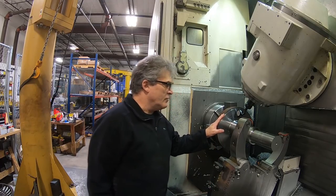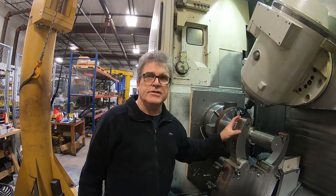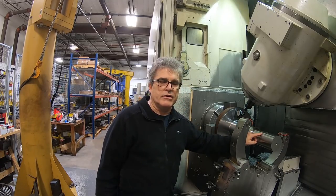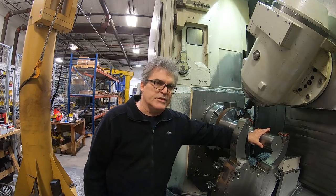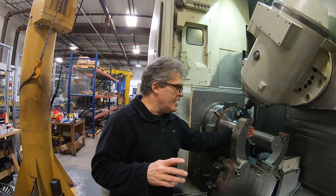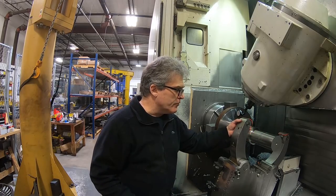On the previous video, I was discussing this steady rest and how to adjust things. My intention was to show the forces on the steady rest if you didn't have the end of the part running true out here in relation to up here. I should have included this in the previous video, but I wouldn't normally even do it that way - just for demonstration purposes, or maybe if you didn't have enough stock on the part to skim a band for your rollers to run on.